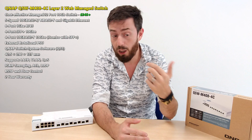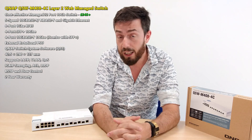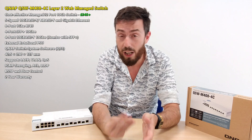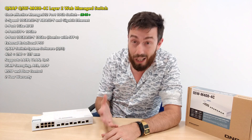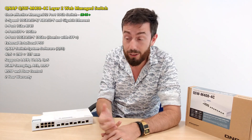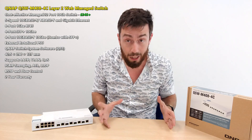The second thing is: are you going to go with copper or fiber? Copper being the more traditional RJ45, and fiber generally being considered SFP cabling. Normally you have to choose between them to a greater or lesser degree. And thirdly, you have to talk about protocol - are you going to utilize a switch that's basically just going to manage, or do you want one that's actually going to be proactive with regard to security, combining ports and connections, and ultimately giving you a far more controllable and customizable platform?